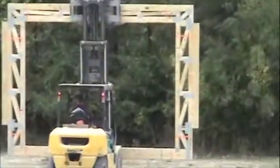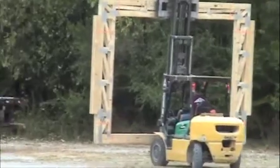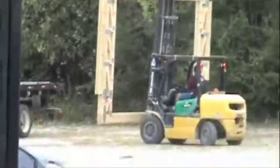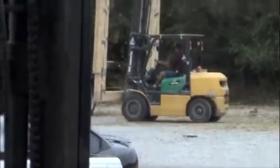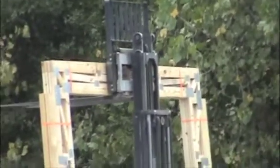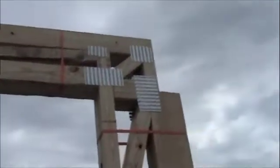That's one rib. That side part notches in, and the inner sub portions — those are the walls. It's actually upside down. The bottom part would actually be the ceiling, and the top part that the forklift is holding would actually be the floor. This is upside down, but it's just easier for them to transport via the forklift that way. Each one will be self-contained, as mentioned before, for the conduit and the plumbing and the HVAC work as they fit through each one. Again, these being upside down is just the way they're transported.